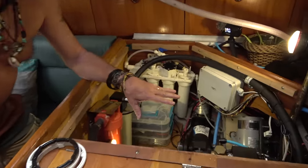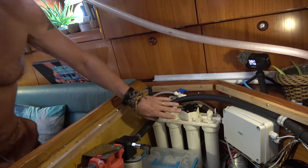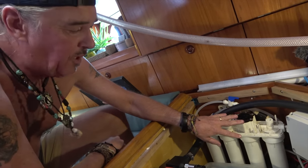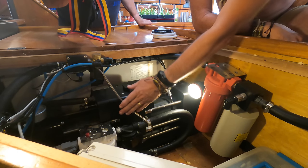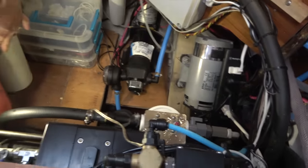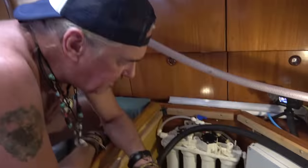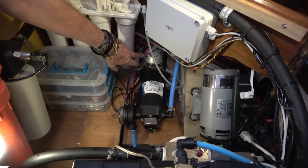I've already opened up our water locker — this is the entire water system contained in one box, the custom cabinet we built last year. On this side is our reverse osmosis system, the post-treatment system after we desalinate ocean water. On this side is all the reverse osmosis desalinator — the high-pressure system. It's modular with a lot of different components: the RO membrane, the pump, pre-filters and post-filters, the electronic control module, the power distribution box, and down here is our main ship's water pump, which is the pre-pressure feed system for the reverse osmosis.